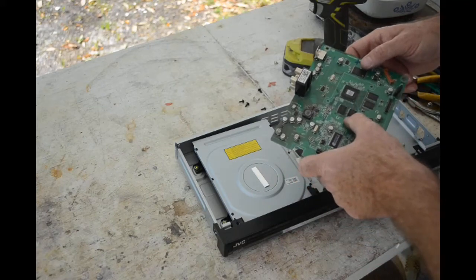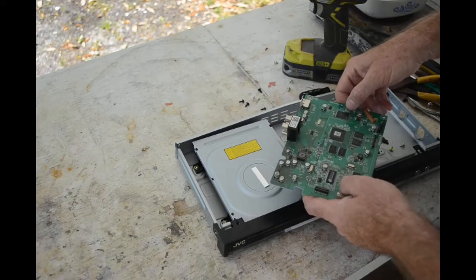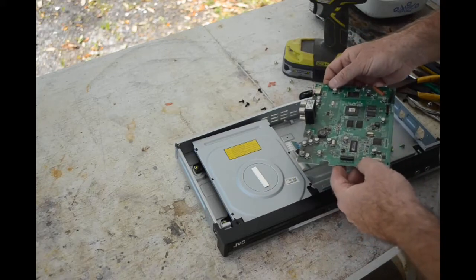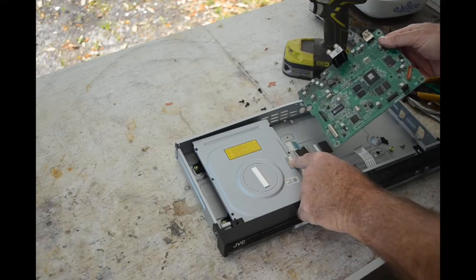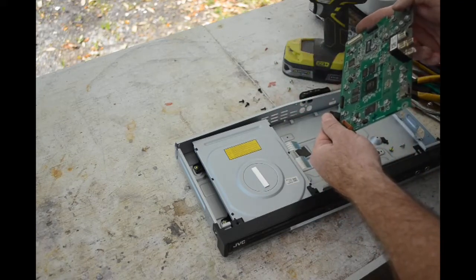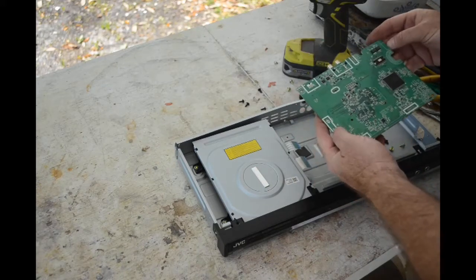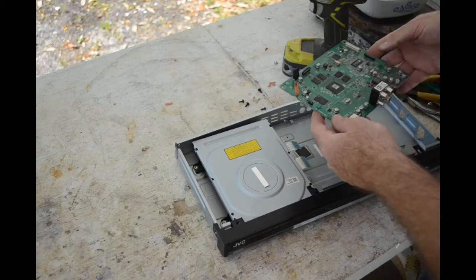Still, we've got one, two, three, four — looks like four BGA memory chips, another chip, a crystal, some big chunky MLCCs. The HDMI connector has gold pins in it — that's nice. There are gold pins inside this other connector that mated with the gold fingers on that ribbon cable. So there is some gold to be had here. Another big power transistor or regulator over here, another transistor here, and some gold header pins. Not a lot, but nothing to throw away either.